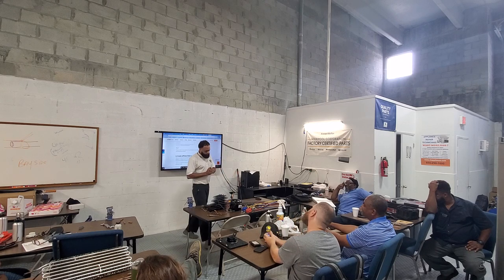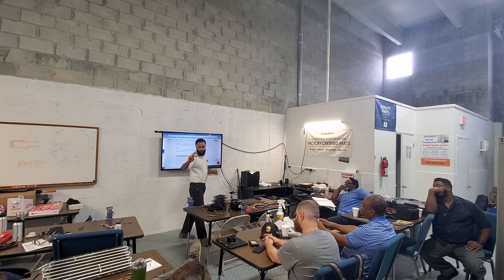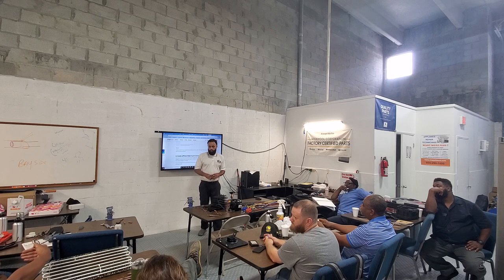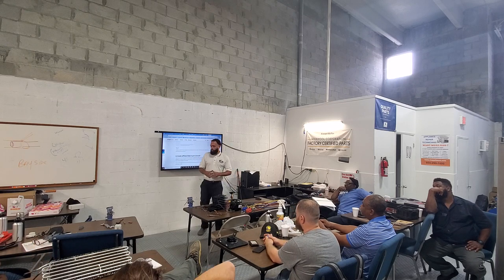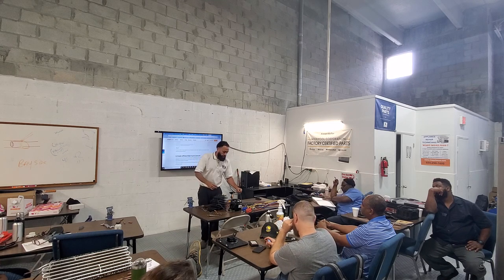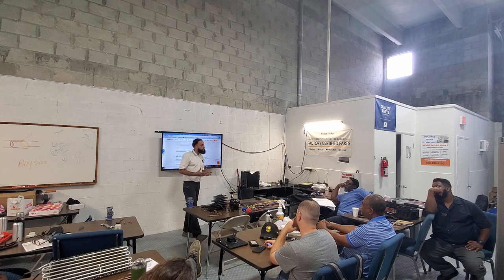Now, you put that on, you got two more choices. Put whichever one is the furthest back, which is most of the time the suction line, put that one on first. You better look for the thinner one, put it where the thinner one goes, the thicker one, make sure it goes where the thicker one goes. Right? And this is a bonus question, you sir. The suction and the process share one common characteristic. What is that?